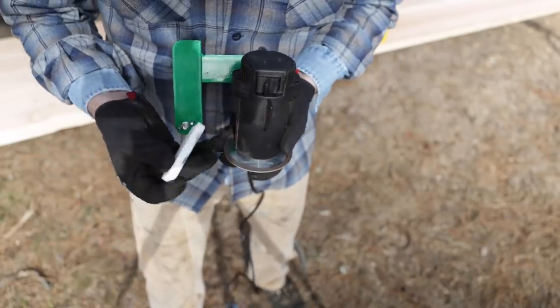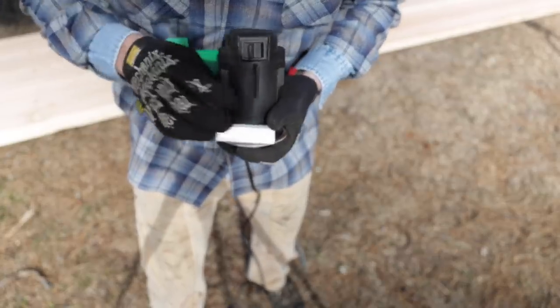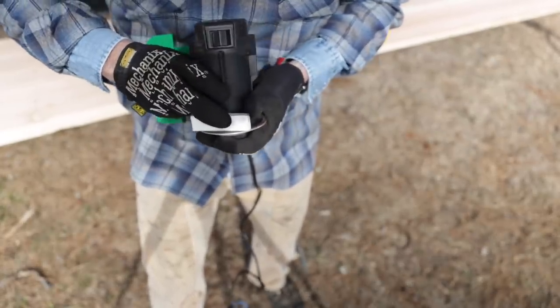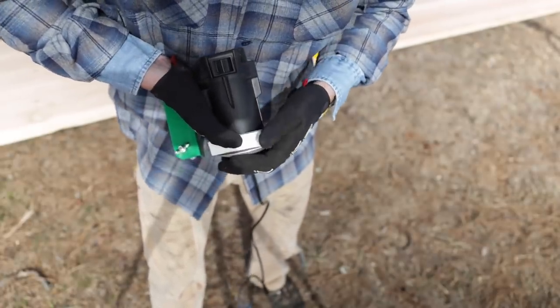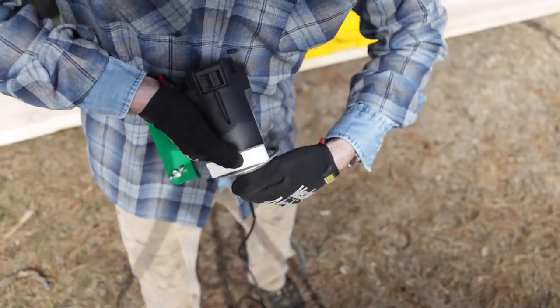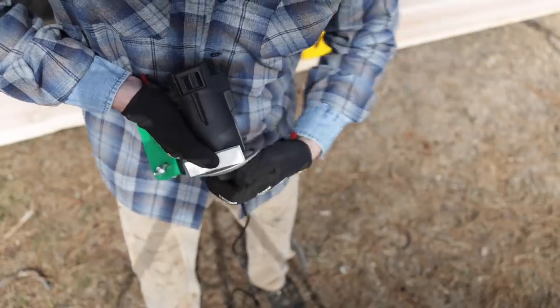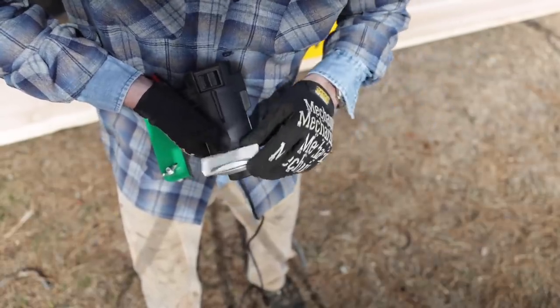You do need to dress these stones from time to time. This little stone comes in the kit — I've only had to do it one time and it's very simple. All you do is hold that on there with your thumb at 90 degrees against the body and turn it. That's just going to true that edge up. Keep going until you see the black basically gone.